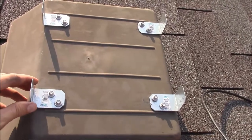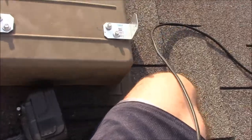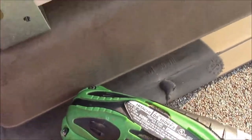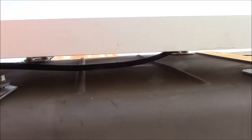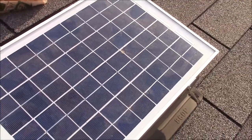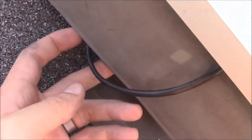We've got the brackets on and they fit nice and snug. Now we need to drill holes in the sides of the solar panel so we can mount it, and I've got some sheet metal screws to connect them. Once mounted, we wanted to give a little bit of space underneath for cooling the panel, but not so much that it catches wind and rips off. It's secure — especially important here in Texas with wind and possible tornadoes.